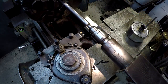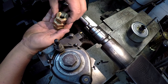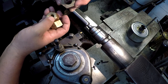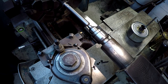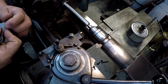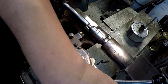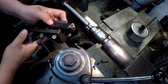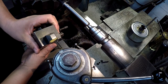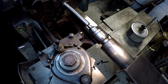Now we're going to do some threading. I went ahead and cleaned the three nuts off - I haven't buffed them or anything, but I sprayed them with the tarnish remover and then rinsed them in water. I'm hoping that the threads are cleaned out on the inside by rinsing them, but I may have to run a tap through them. The threading tool I'm going to use - make sure you've got your pitch gauge so you can double check your thread. We're cutting a 10 pitch - that's national coarse for three quarter. We're going to use a TNMC 43 NV threading insert. This is more of an older style of threading tool, but I still have plenty of those inserts around my shop.